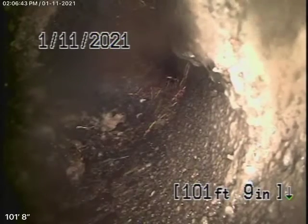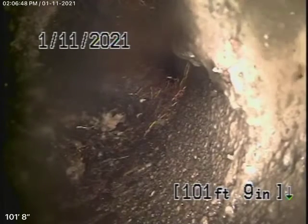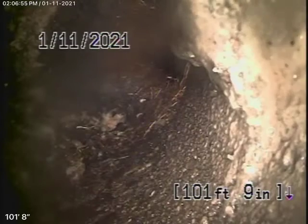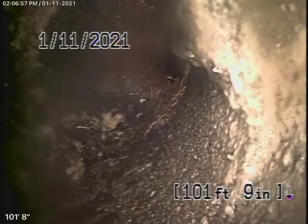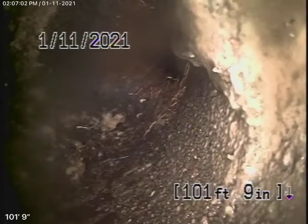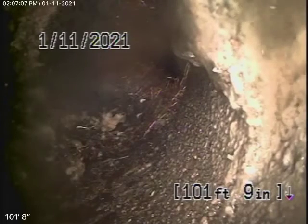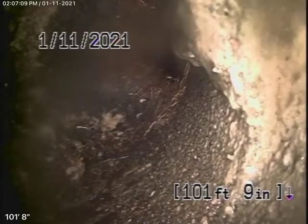We're here at 4525 or 4527 Hunger Avenue Boulevard in North Hollywood. This is a triplex that we're inspecting and we're running our camera through the main sewer line now. We're going to run our camera wherever we can access the main line clean out. So far we've found two clean outs — one on the side of the house, an end-of-line clean out that goes into the building, and another clean out in the front in the garden.